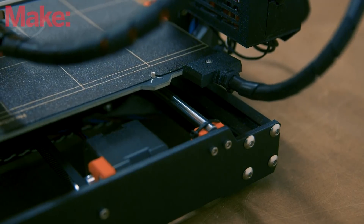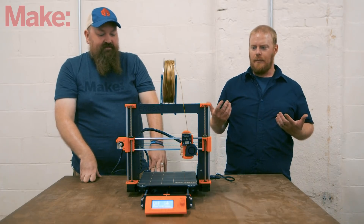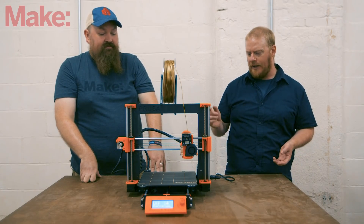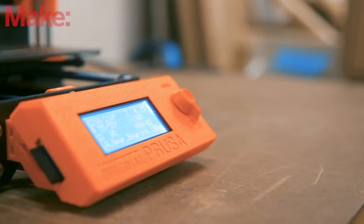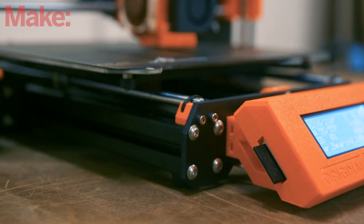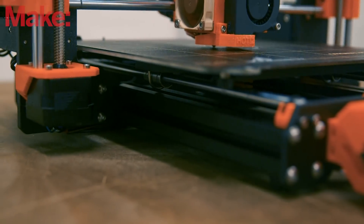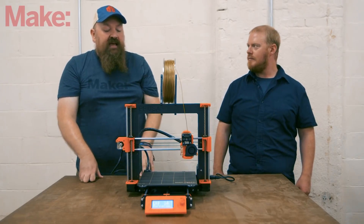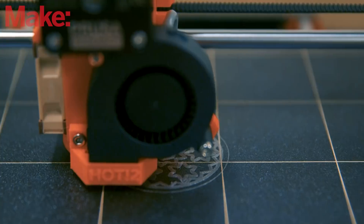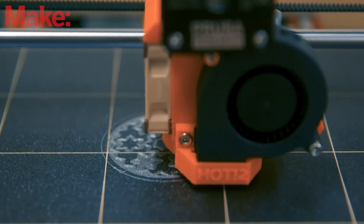There are a couple of other nice things about the machine as well. The MK2, for all its high points, used a threaded rod frame — a lot of people thought less of it for that. The MK3 uses aluminum extrusions, which if you're building it from a kit means you'll be able to get the machine square and true a lot easier. On the MK2, they helped with squareness by being the first machine to do a calibration not only for leveling the build plate but also for squareness, so if you got close enough it would compensate and tell you how close you are. But with aluminum extrusions, everything bolts in — it's going to be stiffer and more robust.